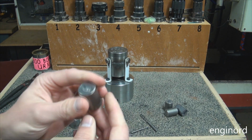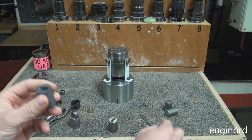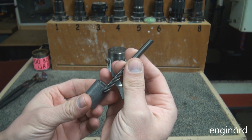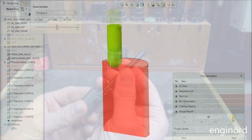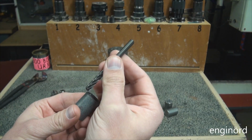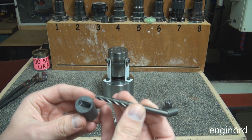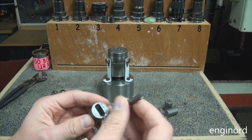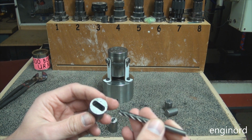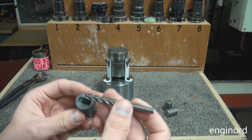As far as the pre-machined parts go, the initial part that I created just used the simple tool path, where a quarter inch tool just came in like so, and then it created that half rounded cavity. Obviously, it was going down and down and down, and then finally it created a finished pass. Now the problem with that is you cannot cut a quarter inch slot with a quarter inch end mill, because it's gonna have runout, and you need to evacuate the chips, so there's all kinds of problems involved. But that slot will become about 6.5 millimeters instead of 6.35, so 6.5, 6.7 millimeters, that's what I measured.